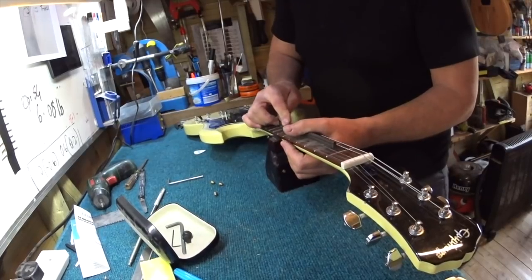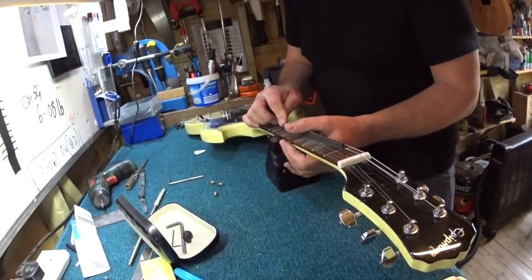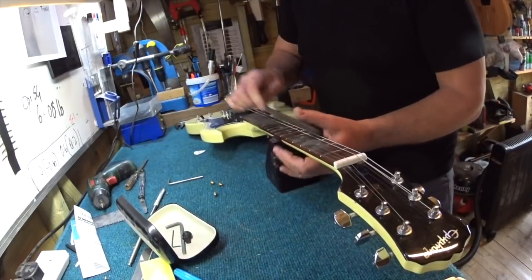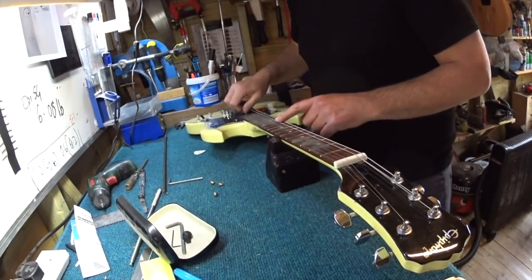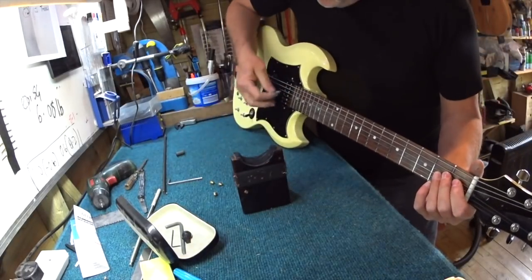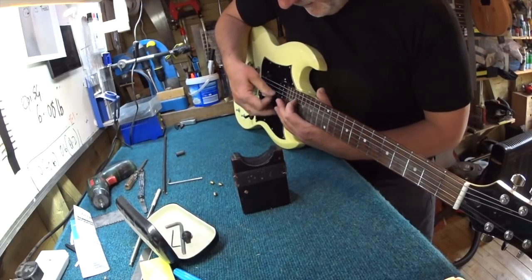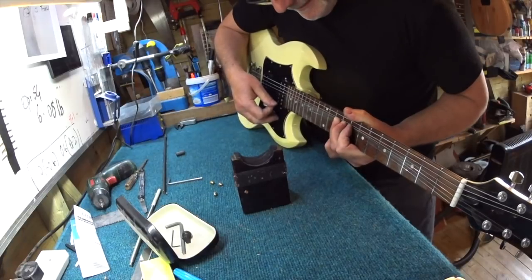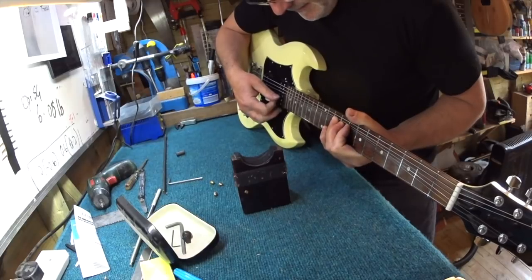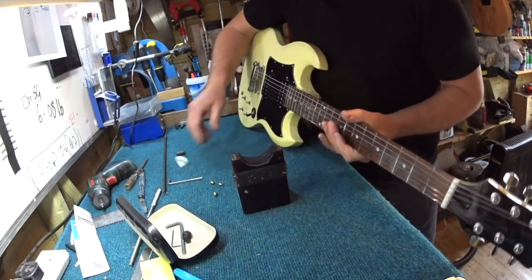Again, two and three are cutting quite substantially. You've got low spot around five and six. And we're expecting 11, 12 to cut. Particularly, yeah, there they are, 11 and 12 cutting, and 13 and 14 for that matter. So now, that's over into the A zone.